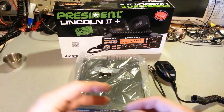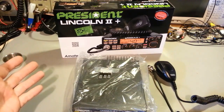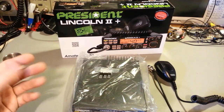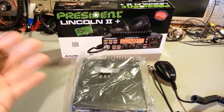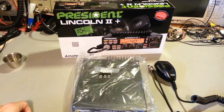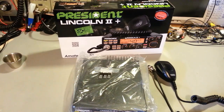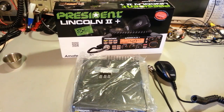That's why whenever you receive parts like this, they'll be in an anti-static tube. It may be a plastic tube but it's coated with an anti-static or conductive coating. Same thing with bags — if they're the aluminized bags, they should be conductive. Or you can get ones that are a plastic bag but with an anti-static coating. I store components like this by sticking them in carbon conductive foam — I reach around and pull one of my drawers out with that stuff in it.